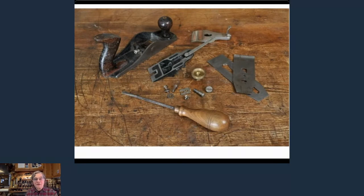You can also get planes that have been cobbled together — someone bought planes with broken bodies or frogs, combined the pieces, and made a plane out of it. That's okay if they combine all the same-series parts, but sometimes they just throw them together. I shy away from those — wrong parts in the wrong planes can be a real headache. The parts from generation to generation are similar but not exact. That's why I like nice even patination across the whole plane — it shows it hasn't been messed with or fiddled to look better than it is.